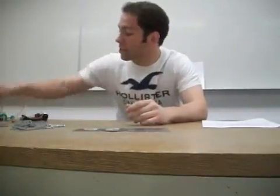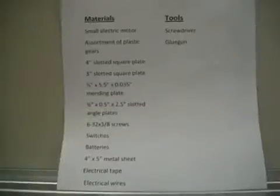My project was to design a cage for the SeaPerch rover that will be closed by a motor and gear system. It's pretty simple. First, we're going to make a platform on which the cage and all the motors sit, and the platform attaches to the bottom of the SeaPerch. And there will be a motor that turns a gear system that we're going to make, and the gears will be attached to the cage. So first we're going to make the cage.